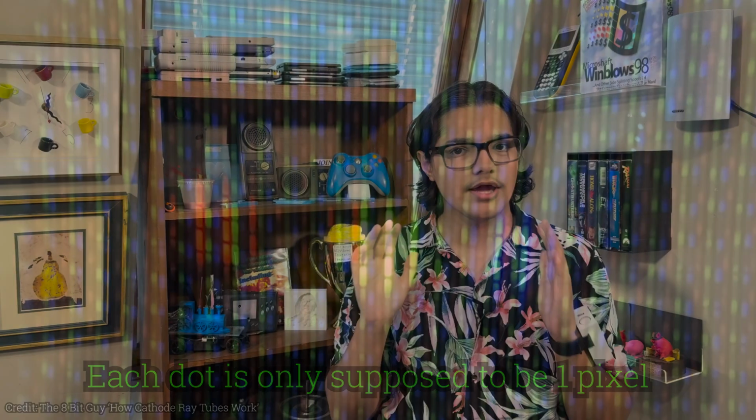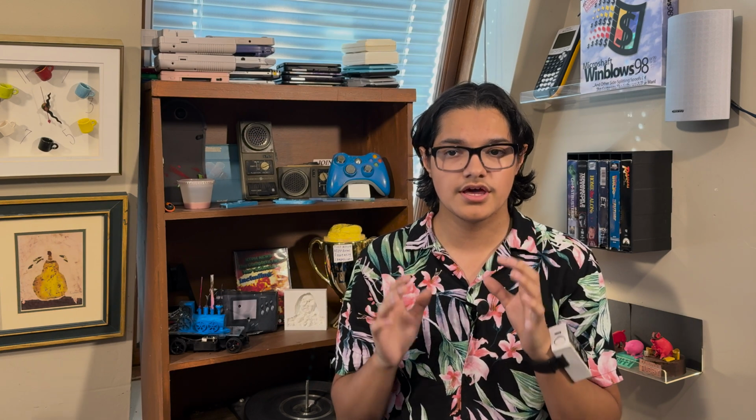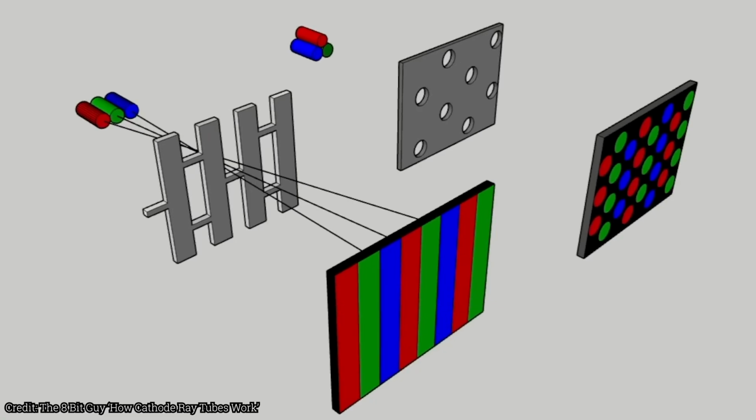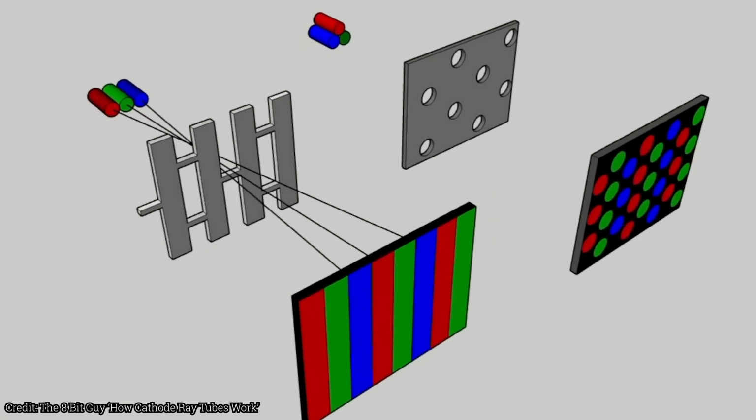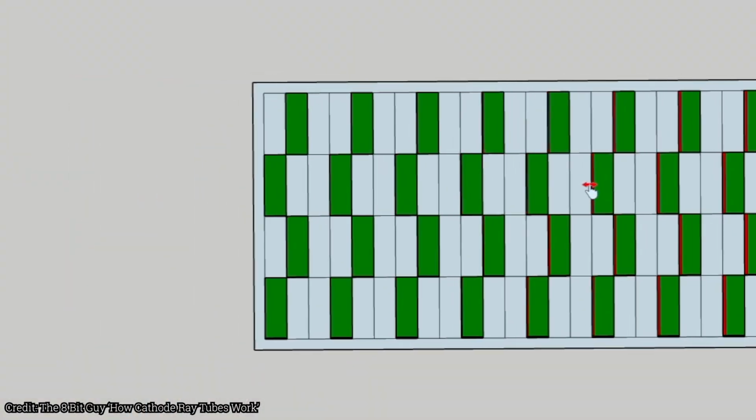If you look at my watch, the screen is actually black and white, even though in the 80s color TVs had existed for decades. What's with that? Well, in order to make a CRT display color, you need 3 beams positioned in a way where each beam can see certain parts of the screen. To do it, they use what's called a shadow mask, which allows for the individual colors to only show in their respective areas, making the illusion of more than 3 colors possible. This means on top of fitting all those extra components in, you need a very, very fine shadow mask in order to make the resolution bearable. Doesn't really matter for me though, since I'm only displaying numbers, not art or video, though it would be pretty nice to have some sort of color going on there.